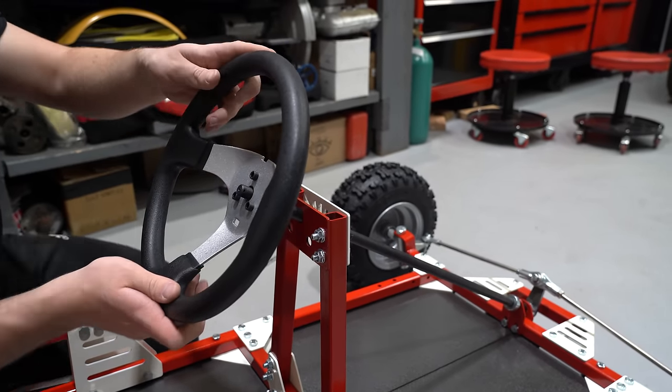Mark what pin you need to remove to have this inner link be the end of your chain. Put it in your chain break, tighten the big nut, and then this smaller handle will remove the pin. Now that we've removed our pin, our chain is broken — we took out ten links here but make sure you measure for yourself. Put our master link in where the clip side is away from the clutch, and when we install the clip the tail trails — the open part will go away from the direction of rotation of the chain. We'll double check that our sprockets are lined up, then tighten down our inside lock collar. Then we'll add our keyway to our sprocket hub and use a normal 45mm bolt for the brakes with a nylon lock nut.